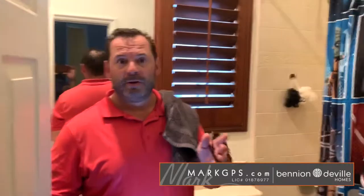Last thing: in the kitchen, underneath the sink there's some slight leaking from the drain pipe. The cabinet is very full so I didn't empty it to see the full extent, but there is standing water under there from the drain pipe leak. The drain pipe needs to be tightened up or rebuilt — even if it needs a new pressure ring, just rebuilt.